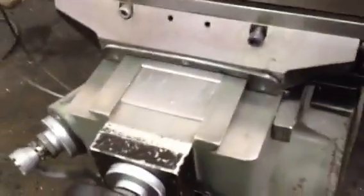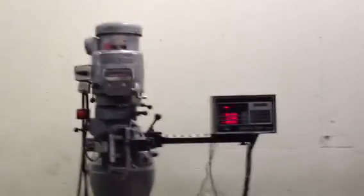The table's nice and clean. Dovetail ways — there's a little bit of wear, but not too bad. The serial number of the machine is 12BR236906. It's a 9x42 table, by the way, with about 26 inches of X travel.